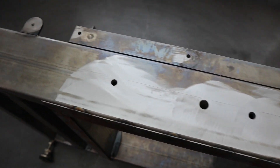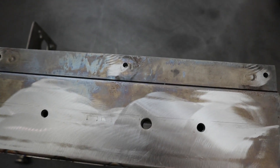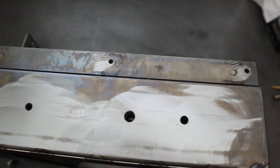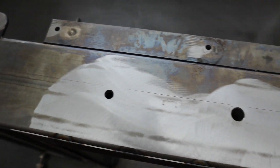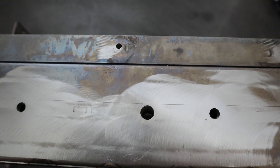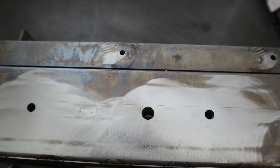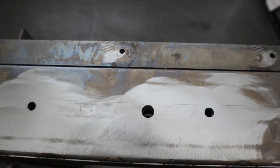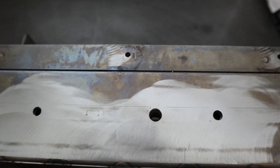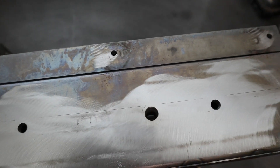Both nuts are welded into the side of the frame, as well as the tube that allows the wiring to the heating elements to pass through it. They're nice and flush — I went across it with the grinder to knock down the welds, then put a chamfer on it so it won't chafe the wire. I'm also going to add a fiberglass sleeve over the wiring to act as an insulator and keep the wires from getting abraded by the metal.